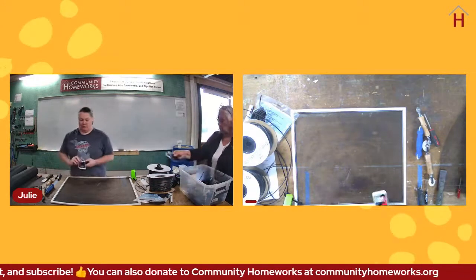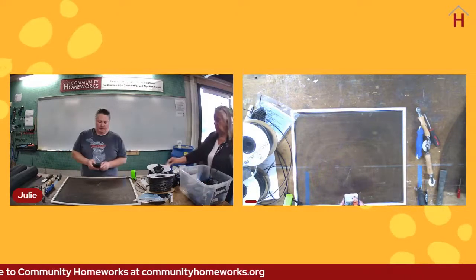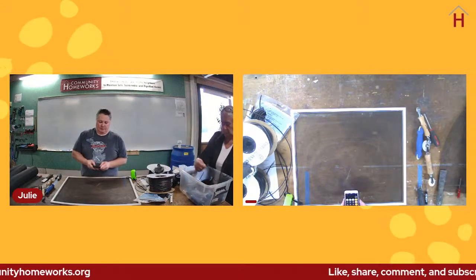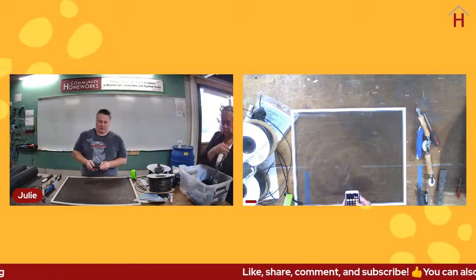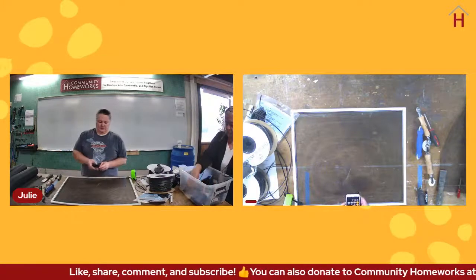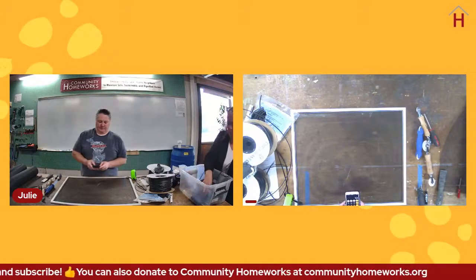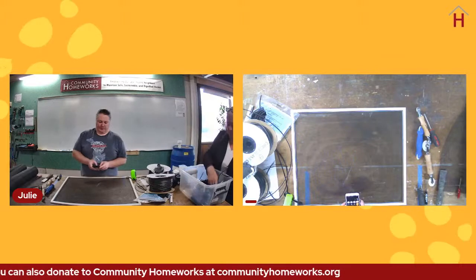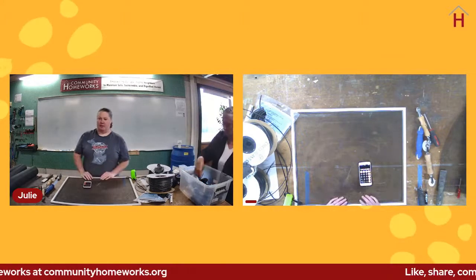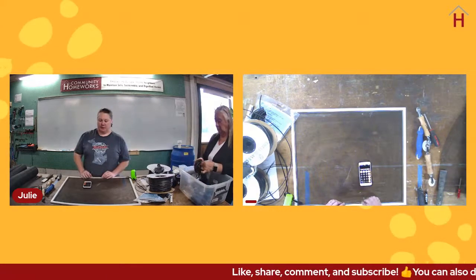And if you're concerned that you won't have enough, you can always add a little bit of extra. So I'm going to go ahead and do our math there. 47 times 2 equals 94. We'll divide that by 12 to get it into feet instead of inches, except that I can't tell multiplication from division. And so that is 7.8 feet. So I'd round that up to 8 or 9 feet, and then I would know I would have enough spline.